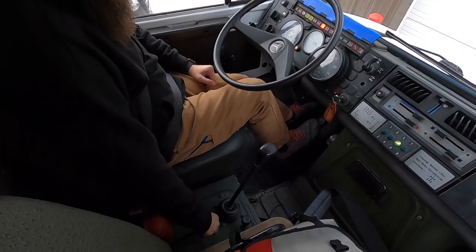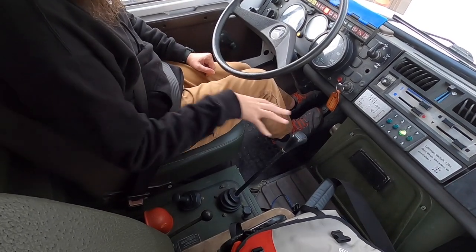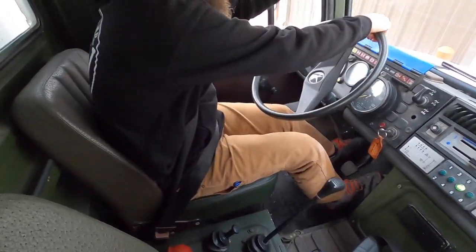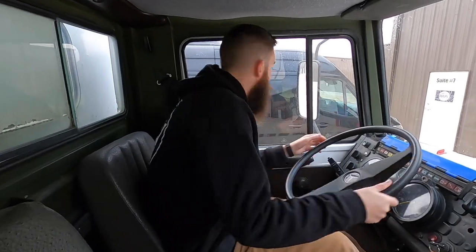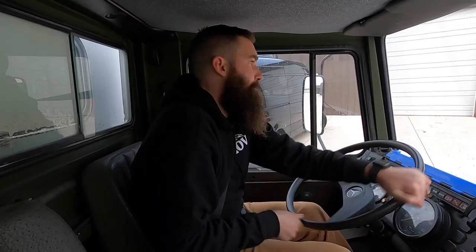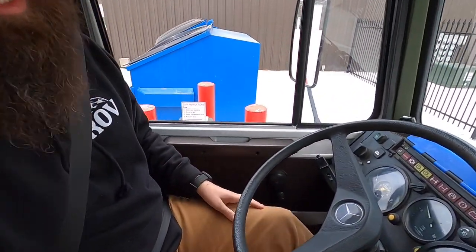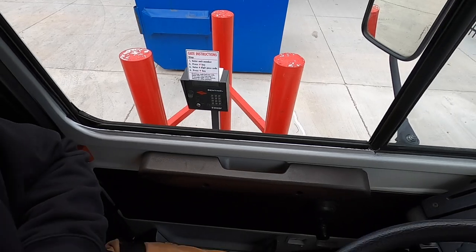All right, driving a Unimog's pretty much like driving any other vehicle. You got your 8-speed manual transmission, forward reverse, which is not on the actual gear shifter. You get all gears in reverse as well. Parking brake, everything is air over hydraulic. It's a little bumpy. And now you would go forward. Getting down to my code thing is a little low down there.